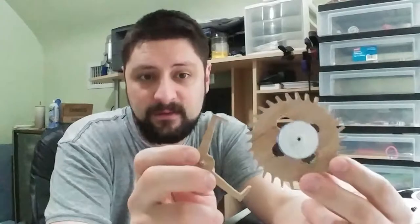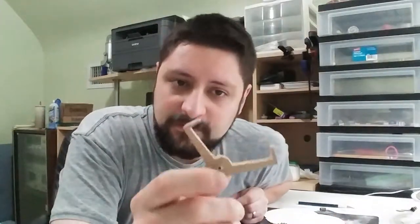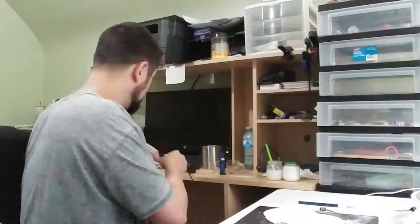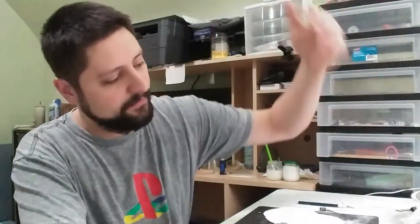The problem I just found out — I thought the issue was with the anchor, or the verge as they call it. I'm going to keep calling it an anchor. This verge didn't work. This verge didn't work. This verge didn't work either. And neither did this one. I've got all these verges I'm trying and testing, and I've drilled the hole, covered it up, and drilled it again in the clock to move it around. It's a pain to adjust because there's no adjustment mechanism — I just have to get the hole right.